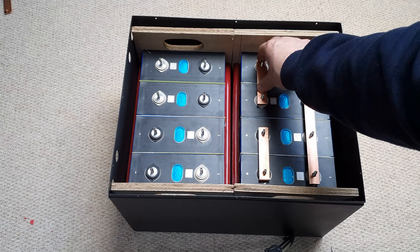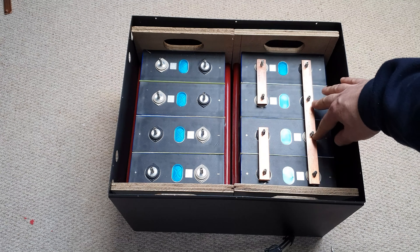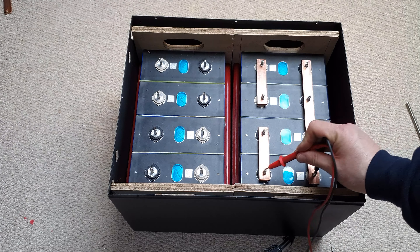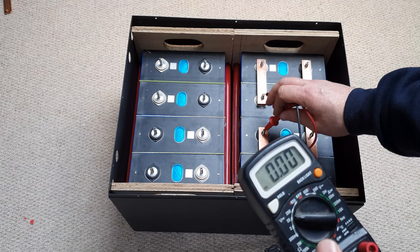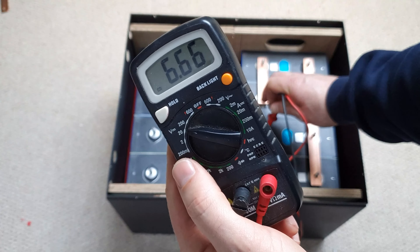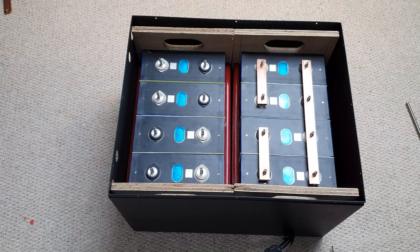These are machined to fit. So that is now a six volt battery. We have two 3.2 volt batteries here and here in parallel, and then this is the series link between the two making a six volt battery. And just for fun, if we grab our volt meter here — hopefully you will be able to see — if we now put a probe there and there, there is our 6.66 — number of the beast — our 6.66 volt battery. So two 3.3 volt cells as they are at the moment — that is our 6.6 volt battery.